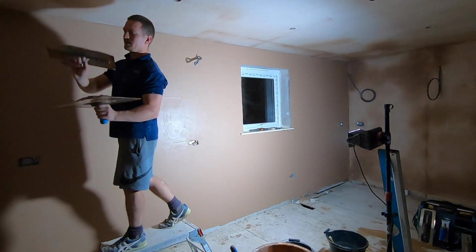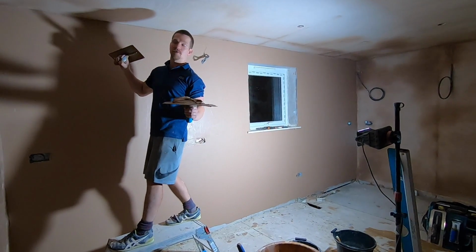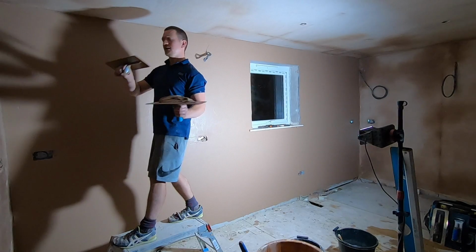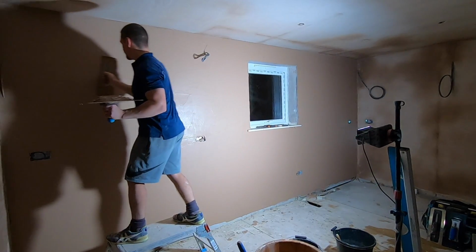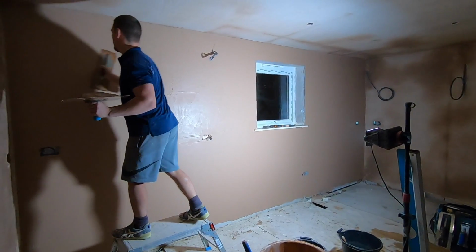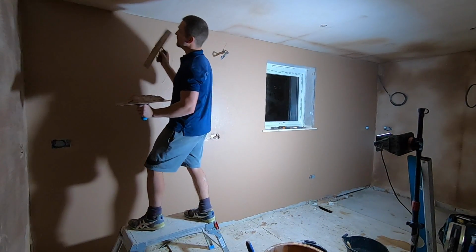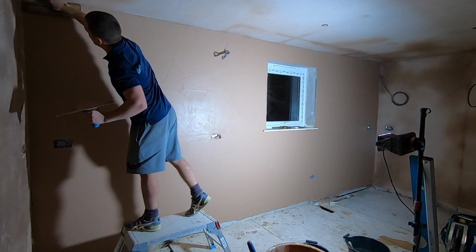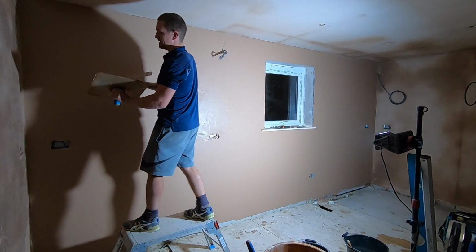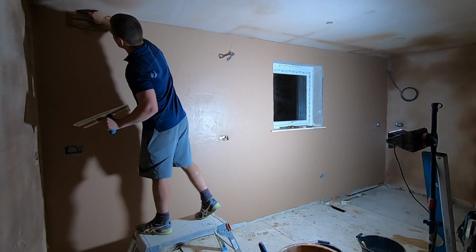Again, plaster, left side of the trowel. Opposite if you're left-handed, we're starting from the right. Again, plaster left side, corner of the room, come out. That's one trowel position to learn. And then again, now the opposite side, plaster on the right side of the trowel, coming to the top, sweeping down. That is another trowel technique to learn. It's a bit trickier, but it's needed.